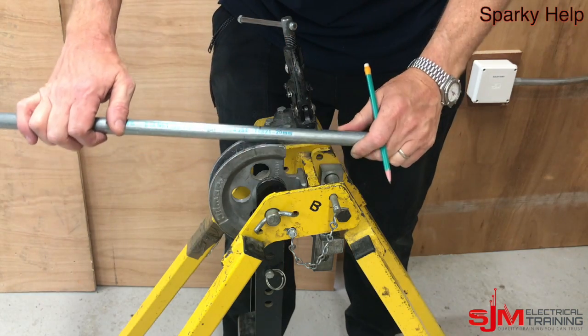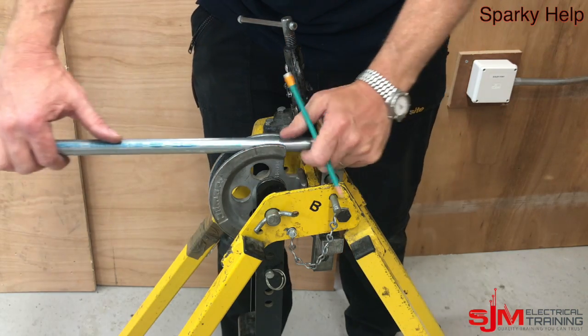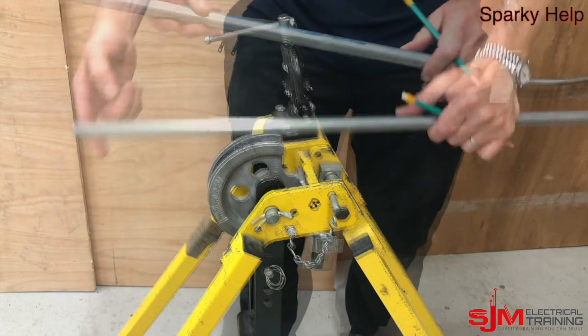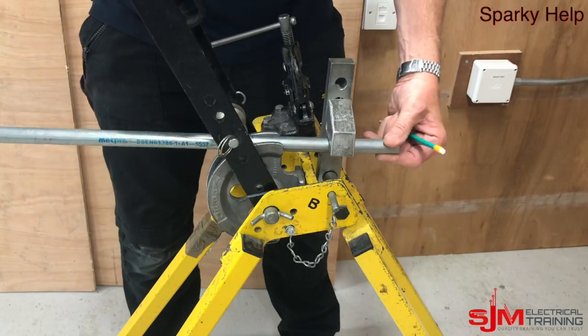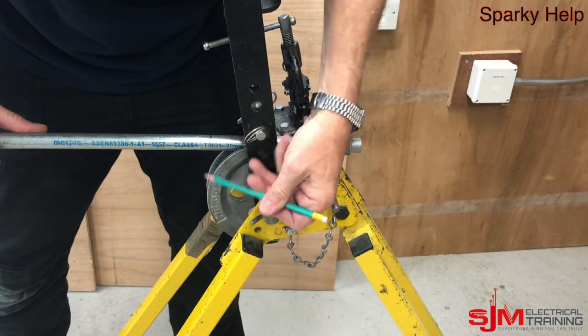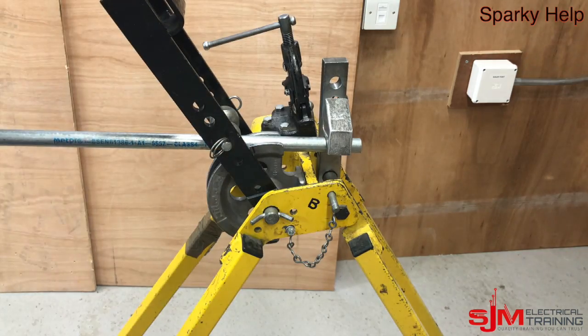All of this will work on the opposite, but it's always harder to bend it up. We need to make sure you don't put it on the line this time — we need the back of bend, which is on the back of the former. You could just look down that with your eye once you get half decent, make sure it's lined up.